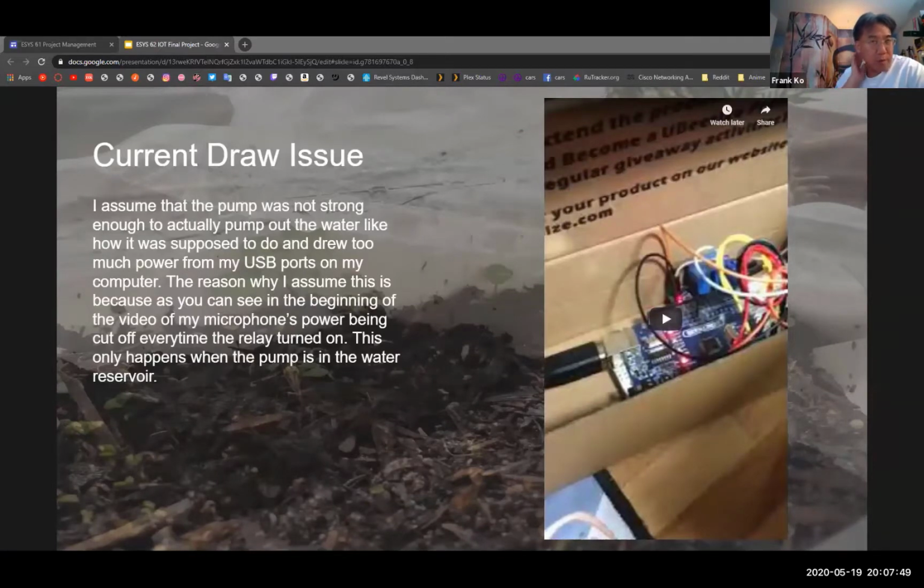You might not remember. Let's see, you were in the PLC class last year, yes? Yes. Okay, one of the very first demonstrations I held for you guys in the PLC class was a PLC controlling an outboard relay, controlling 120 volt light bulbs. And so we were able to demonstrate an AND function versus an OR function: one light bulb coming on, the other light bulb coming on, both light bulbs coming on.